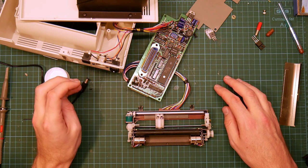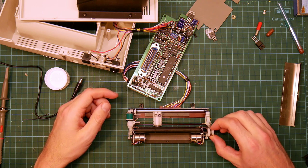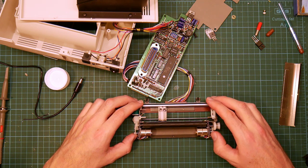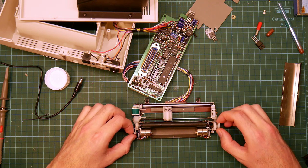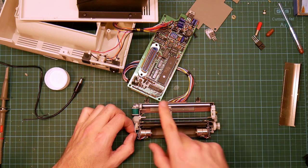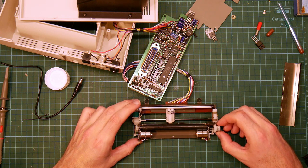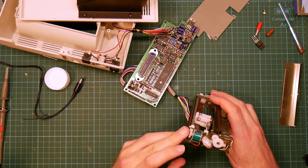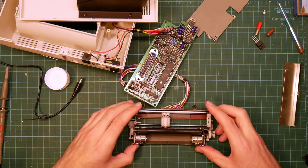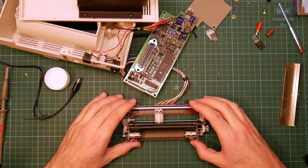The person I talked to also suggested something I really should have thought of myself, which is simply try lubricating the plotter. I didn't actually do this because everything feels quite smooth when I rotate it by hand, but it occurs to me that the motors, being very small and operated at 100 Hz, are probably very low torque. Maybe it's just that the 40-year-old lubricant in the bearings has slowly gummed up over time, and it worked for a bit and then something got sticky and it stopped working. So let's give that a go.